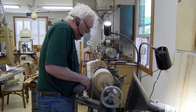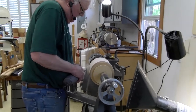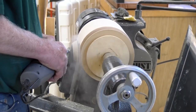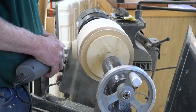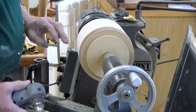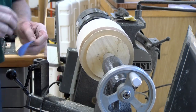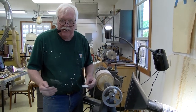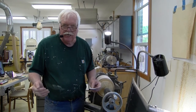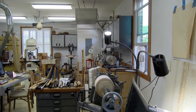Did you see the dust being sucked out of there? It's real important. Maple is a pretty wood. It's real important when you start off sanding with heavier grits to make sure all your tool marks are gone. After that you don't have to use as much force — you're just knocking off the scratch marks from the previous grits. That's 100 grit; here comes 120.